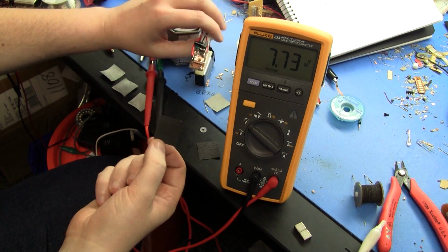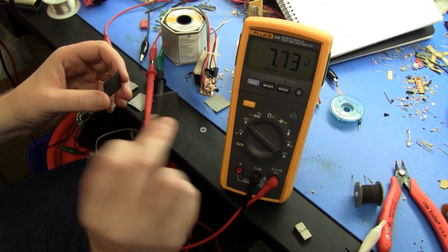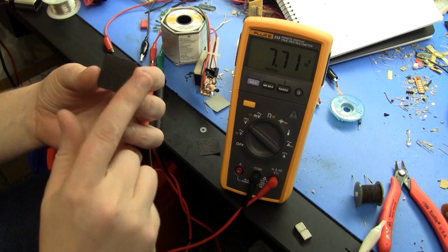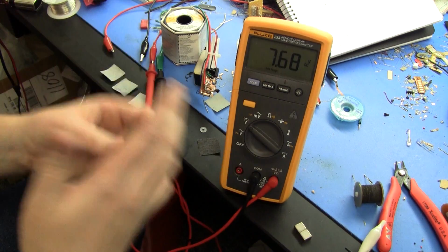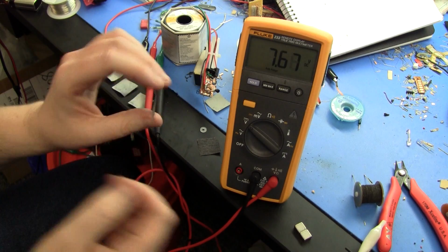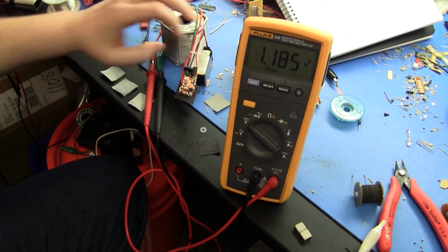Anyway, this is cell-added zinc sulfate too. So almost saturated solution of zinc sulfate. I just took these normal zinc manganese plates and I dampened the manganese side with the solution just as a quick hack, because it was easy to make a big sheet of it and then try different little swatches. So this was the first cell that sort of told me that I was getting on the right track.